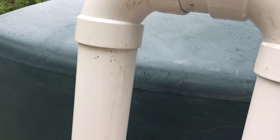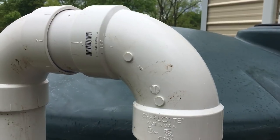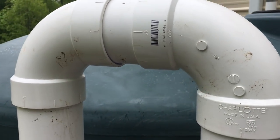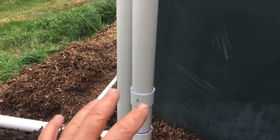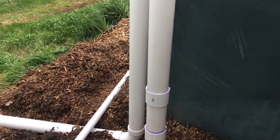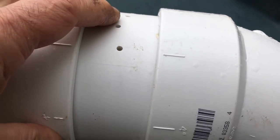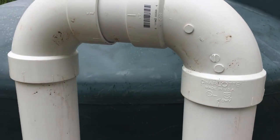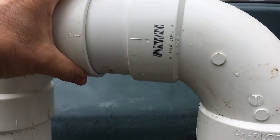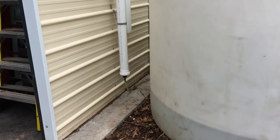Because this is coming from the lowest level, if I get too much water at once this could cause a siphoning effect and basically drain my tanks out through the four-inch pipe. To stop that from happening, I drill a couple of holes in the top up here — that breaks the siphon. It will allow almost four inches of water to go through without leaking out, and then I need to put a screen over this to keep bugs out.